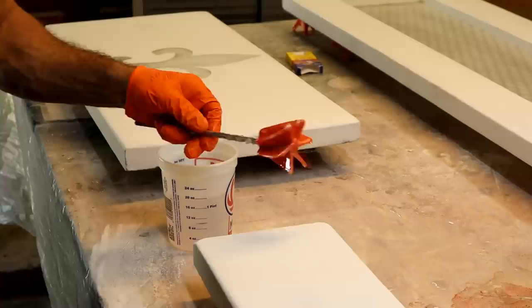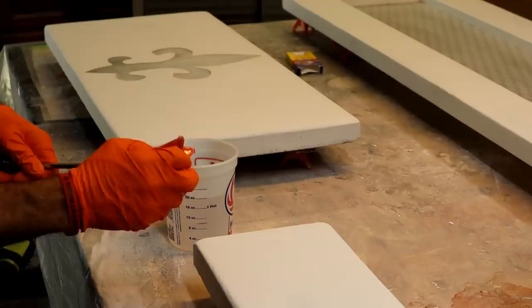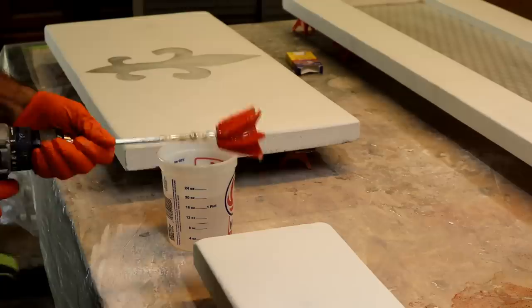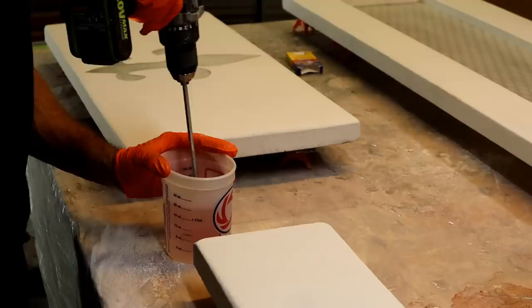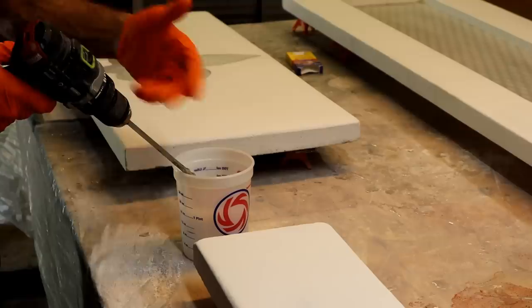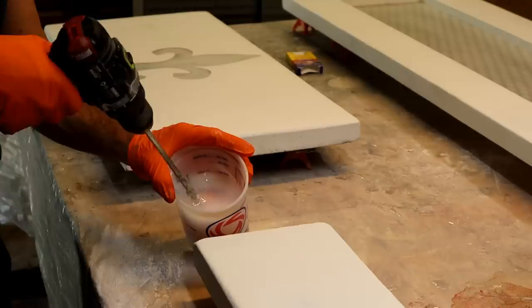These are awesome little mixers. I'll have a link in the description box, but you can pick them up at Lowe's, Home Depot, or Menards — any hardware outlet. They work great. Don't worry about stuff sticking to the mixer; you let it dry and it's still good as long as you don't have flakes on there. I'll put it on low speed and spin it, then put it in reverse after about two minutes and spin it in reverse for a little bit just to make sure I catch everything — it pulls in a different way.